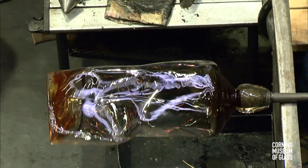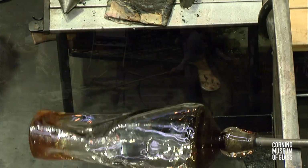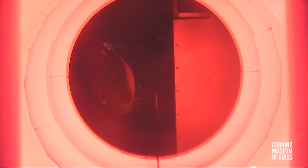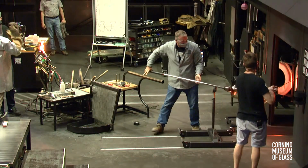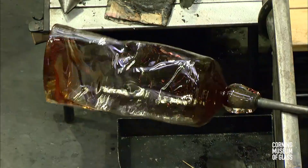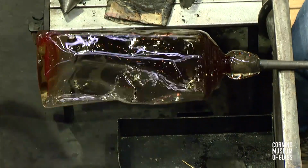Jeff's wearing a big silver jacket that will reflect the heat from him. Some big Kevlar gloves and a face shield. You want to go in the bottom annealer or the top one? Which one's easier for you? The bottom? Okay. We have 2 annealers going, ready for this project. But the annealing temperature starts at 900 degrees for this particular glass. And then there's programs already established in the computer controllers on each of those annealers, so we can set whatever program Richard wants. But I'm imagining 24 hours should be plenty for this. This actually isn't really thick.